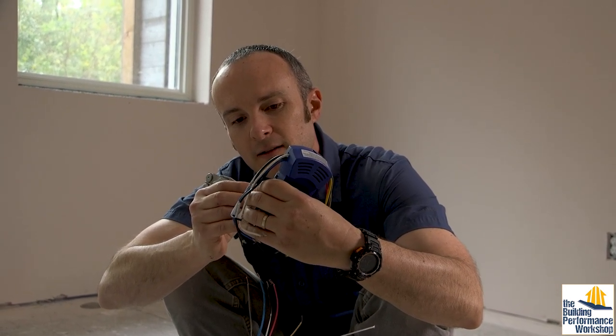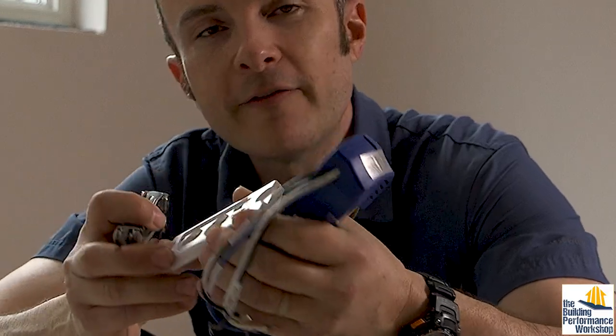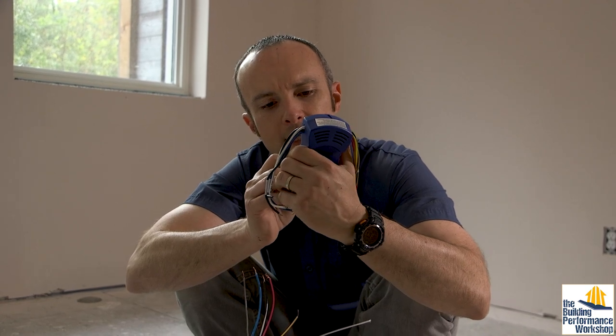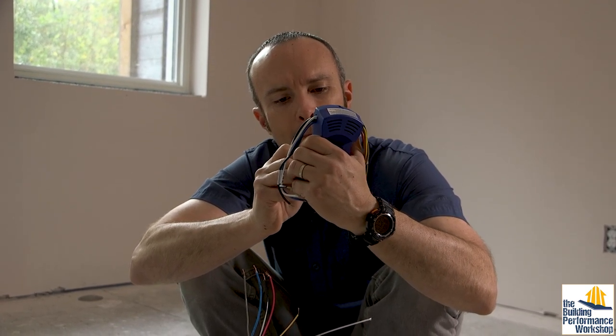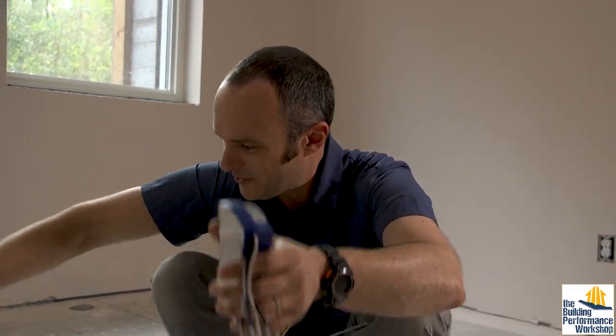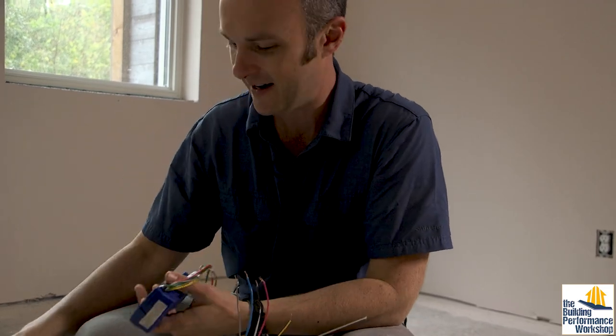There are five pins. I'm having four and five on, and they both need to be at the same frequency. Don't leave it on the default — if you install all your fans and leave them on default, you do one thing with one remote and it'll control all the fans in the entire house.